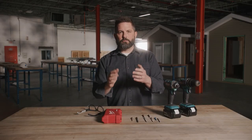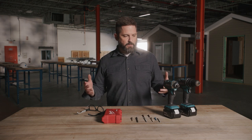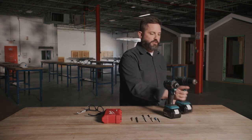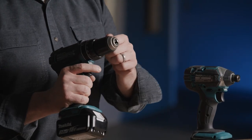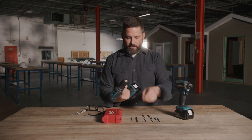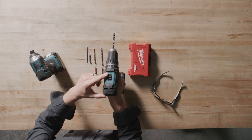I'm going to do a couple of demonstrations with our cordless drill and our impact driver. There's a lot of different equipment and applications, so I chose a few here to show you guys — just a couple of examples of the wide variety of uses for these two tools. So we're going to start with our cordless drill. The cordless drill comes with a chuck. This is a keyless chuck. Drills years ago used to come with a separate key to loosen and tighten this. This chuck will accept a smooth shank bit which you can tighten, and you'll hear it when it cranks down — it gives it a couple of clicks. There are variable speeds.